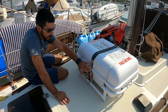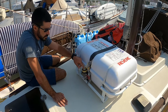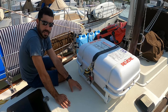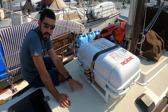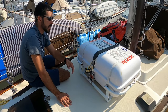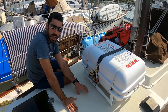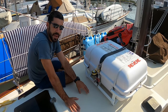That's the basic operation of a hydrostatic release. Obviously there's always a manual option, but I want to emphasize that the preferred method for deployment is manual. You don't want to be sitting there for 15 minutes waiting for your boat to sink and your raft to deploy. You want to ideally get this raft out, get all of your provisions in, get everything you need into that raft, and get everybody accounted for and mustered on deck and into the raft in a safe and timely manner.